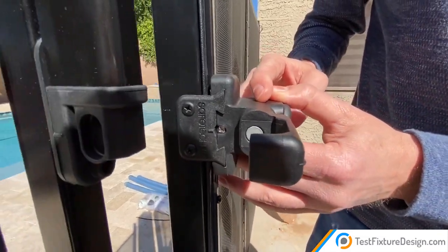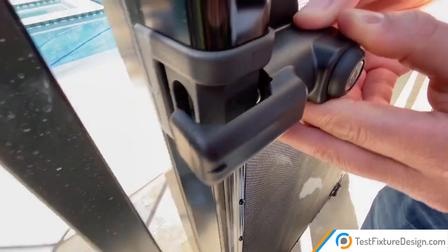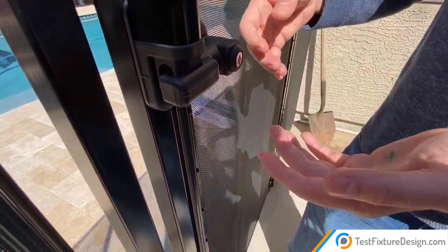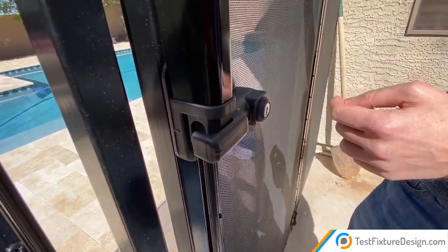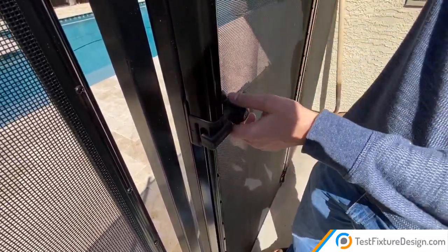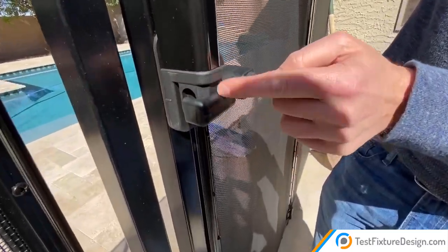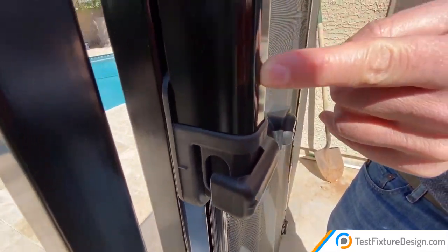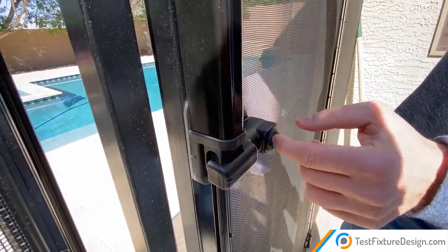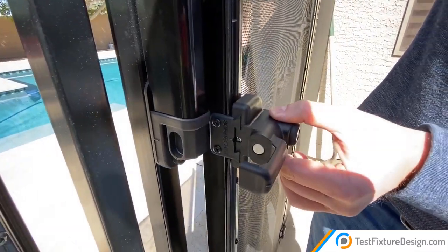What's really cool is when you close it — you can hear that snap sound. I'm guessing there's a magnet in this release rod that attracts the steel pin and pulls it into the closed state. So when I pull this release rod up, there's a magnet sitting down in here and I pull it up — now it's up here. So the magnetic attraction with that pin has been disconnected, and now the spring inside this mechanism has pulled the pin back so you can open the gate.